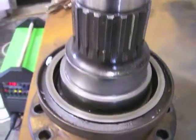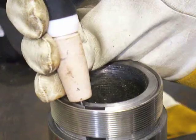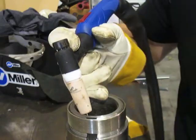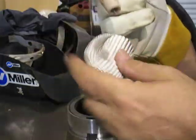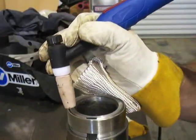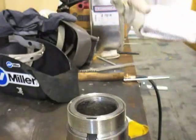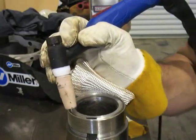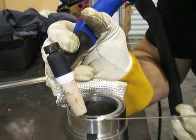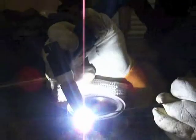Sometimes on jobs like this there's no way to find out the material you're welding — you kind of have to rely on whoever you're doing it for to give you a hint. So what I'm doing today is using Hastelloy W filler metal. It's very expensive, and probably 312 stainless or 309 stainless filler would have done just as well, but I didn't want to take any chances. I got a deal on some Hastelloy W about 20 years ago and I'm still working my way through it. I know it will work because I've used it on so many different combinations of carbon steel, stainless steel, etc.